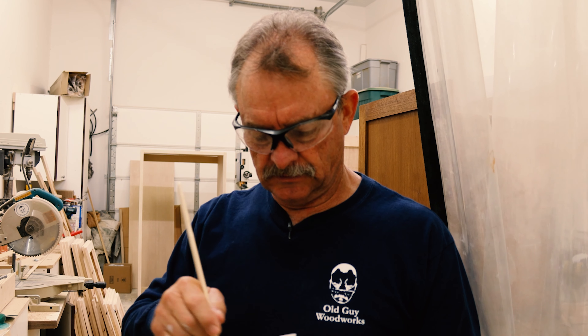Sorry, you can't watch me spray this — it ruins the camera — but this is what it looks like when it's all done. Time to set the shop up to do some lacquer undercoater with the 2.0 red tip. I try to keep a process when I spray: edges and profiles first, then the field. I hand sand everywhere I can, but in these little corners this new tool really works out great.